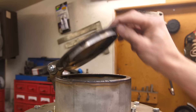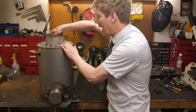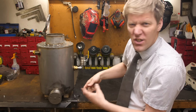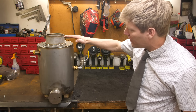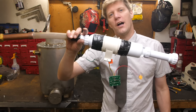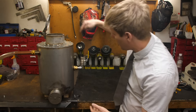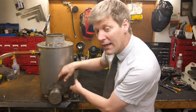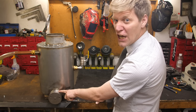You do still fill this little chamber with wood — nice little lid there. All the wood sits at the bottom on a little grate, a little plate with all the holes in. This little handle thing is a shaker, because as it burns it will disintegrate and want to drop out the bottom as slag — that's what that does. You've got to agitate it, flick it around. So you've got a fire at the bottom of a massive grit pile of wood, but it doesn't burn up, it burns down. That's because on the outlet there's going to be a fan attachment — this is a bit crude at the moment, just for the test. That's going to suck air down through the wood into the bit where it's burning, and then pull all the smoke out underneath into the outside of this chamber, and then out to an engine where we can burn it. This little bit at the bottom is my slag catchment area.